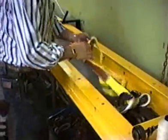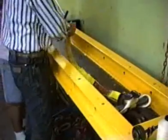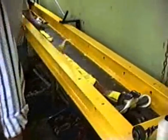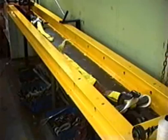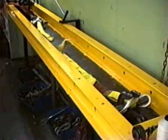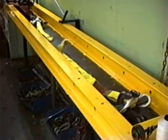So we had much greater damage, the end I thought was going to break didn't, and we got seven times the break strength on a piece of sling webbing that was equivalently strong as that tie-down webbing. This is directly a result of the weave pattern — the stuffer weave design employed in sling webbing that is not employed in tie-down webbing. We're going to go ahead and reposition now for the additional tests on the larger test machine.